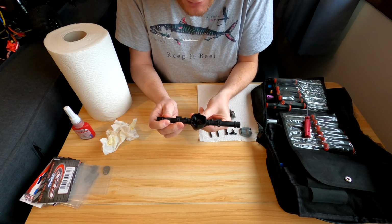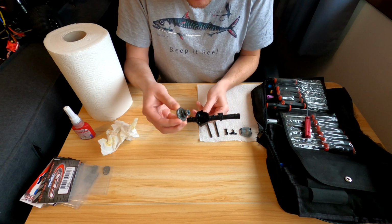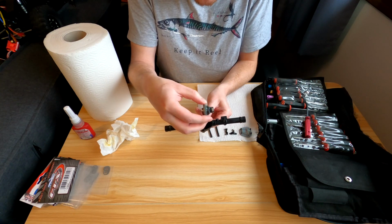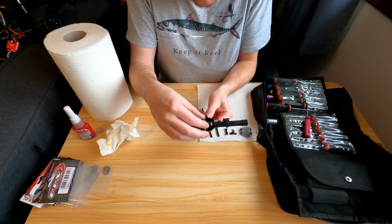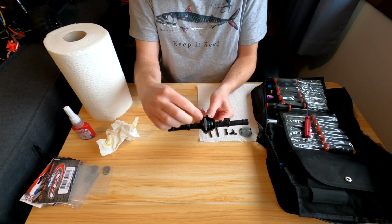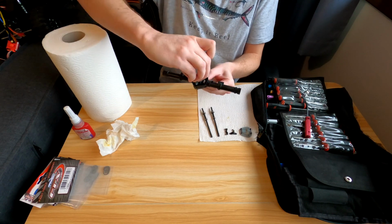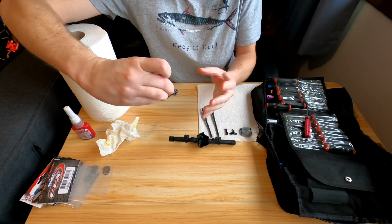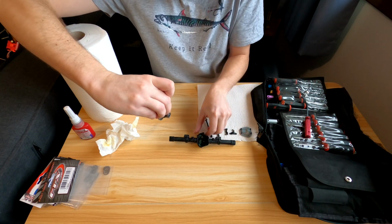You see in there? You get the gear, and these two run off each other. This sits, as you're looking at it, to the left of this one. So it sits that way. Essentially, the two gears are too close together. They're too tightly sandwiched together. The other one is here, and this one's pushed too far against it.